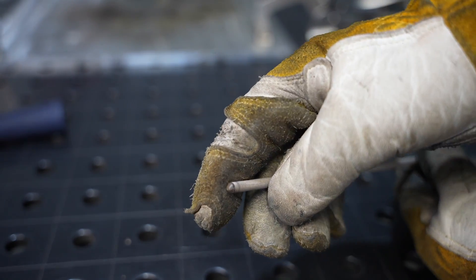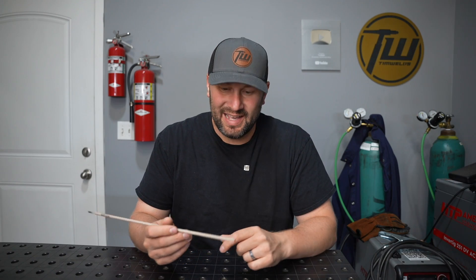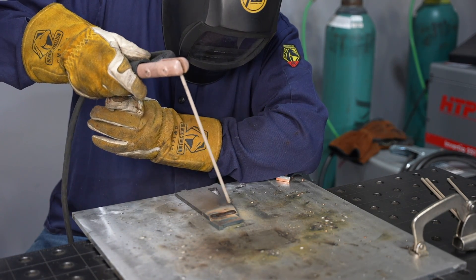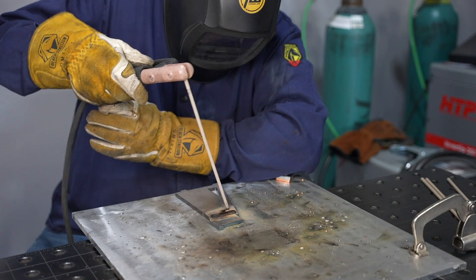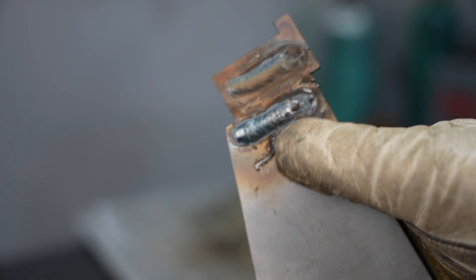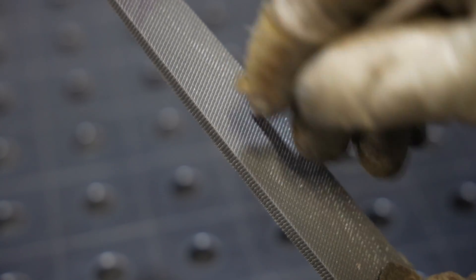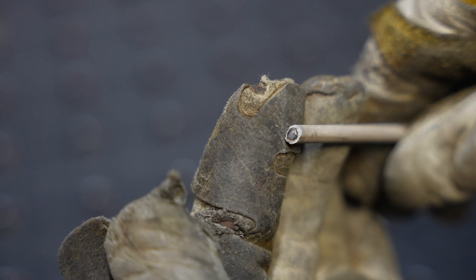When I'm talking about slag, I mean where it's been heated and hardened like a rock on the end. This is much more difficult — the intuition is to just beat on it with your electrode holder, but this is really problematic. Eventually you'll break through it, but you might be in the wrong spot, end up with an arc strike, stick it, and have to start all over. You need that metal exposed at the start. You can use a file or some self-adhesive sandpaper on your bench, take the electrode out, and clean up the end to make sure you have metal exposed for the best chance of success.